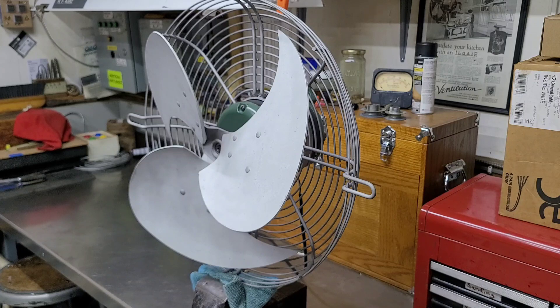The whole motor needed a rewind — it was completely burned. I'm going to show some pictures and footage after this discussion, and you'll see it was pretty crusty. The Model 163 — this is the third one I've had to rewind. The Model 183 and 163 sizes seem to have a pretty high failure rate compared to the other sizes. If you find one that works, count yourself lucky, because I've gotten four, and three out of the four have been dead and burned.